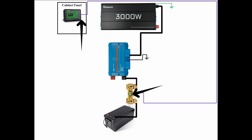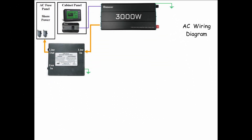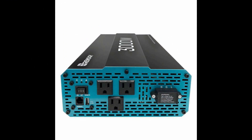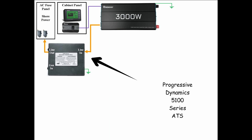The battery monitor is connected to the shunt via this circuit. This is the wiring diagram for the AC side of the circuit. On the back of the Renogy 3000 watt inverter is a hardwired AC connection, which is what I used. There's a port to plug in the remote, and the power switch has the option to set to remote so that you can turn it on and off using the remote. The wiring from the inverter to the automatic transfer switch looks something like this.